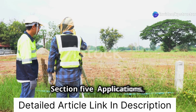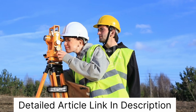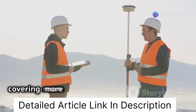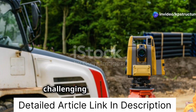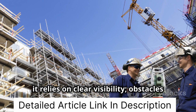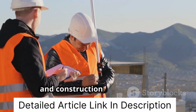Section 5. Applications, advantages, and disadvantages of tacheometric surveying. Tacheometric surveying is versatile, used for topographic maps, roads, railways, and pipelines. Its major advantage is speed and efficiency, covering more ground than traditional methods. Ideal for large-scale projects and challenging terrains like hills, forests, and water bodies. However, it relies on clear visibility. Obstacles can hinder accuracy. Overall, it's an efficient, cost-effective tool for surveyors, engineers, and construction professionals.